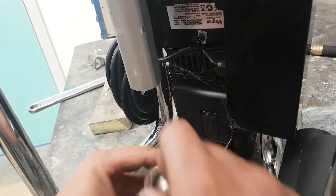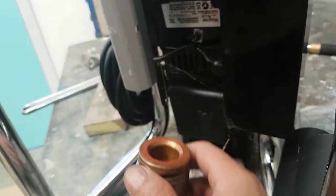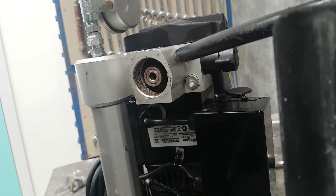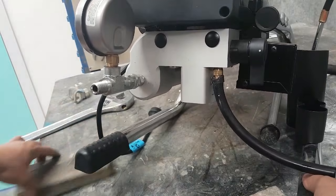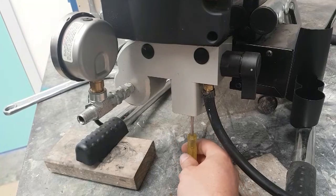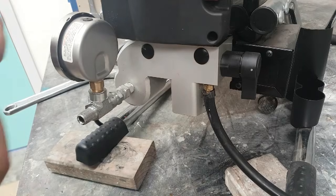Once it's all back together — I'll assemble it, put the cage back in, put the seal back over the top, and put the retainer in. That's all good to go back in now, and I can hear the ball. I know that it's free, and I know the ball that's inside is also free. The way to test the ball on the inside is to have it in the upright position, then just push the screwdriver up into the piston and just listen to the play. That noise you're hearing is actually the ball — so that tells me everything's free and there's nothing stuck.